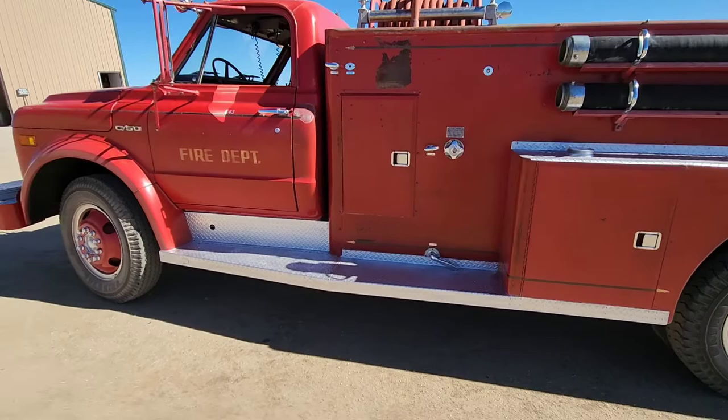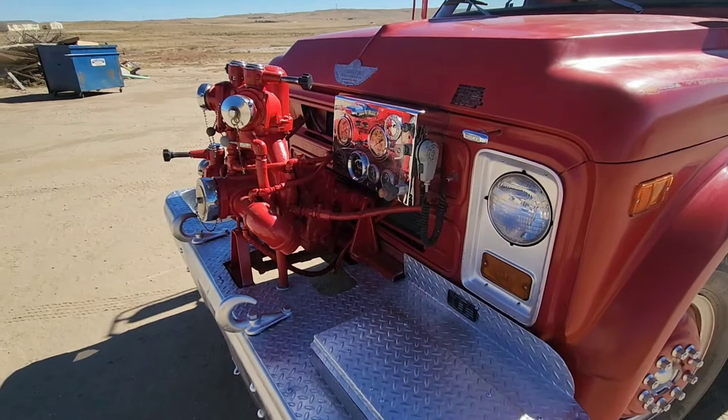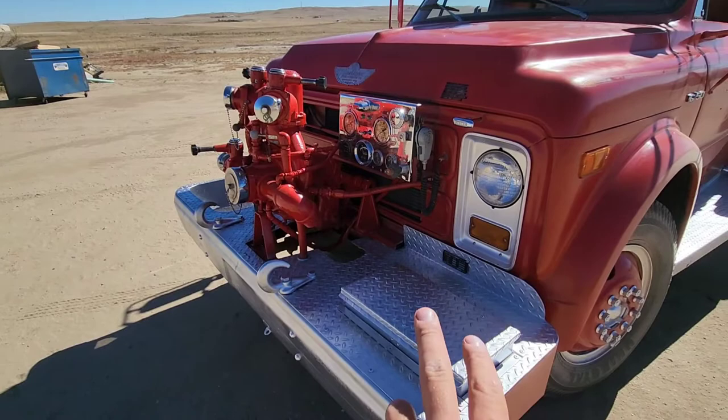And there is a gearbox on the front of the pump here. There's a gearbox in there that leaks oil a little bit, so it probably should get a new seal for it eventually, because it just doesn't hold the gear oil in there very well. But other than those two things, this thing should pump water no problem.